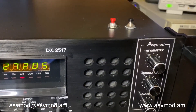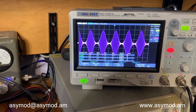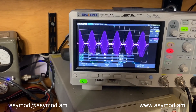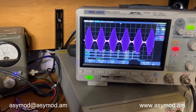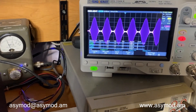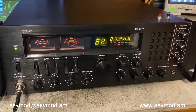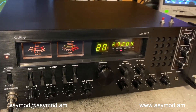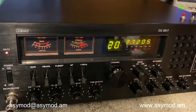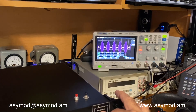Now with your asymmetry, it sounds a little louder. You can bring it up — that's 200% modulation. As you can see, the loudness changes as you change your asymmetry. We're going to key it up and we're going to lower the asymmetry. We're going to go ahead and transmit, and we'll see 100% modulation on the scope with normal readings on the meter. As we bring up the asymmetry, you'll see the modulation and your power output both go up, as well as over there on the scope — now we're doing 200% modulation.